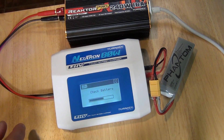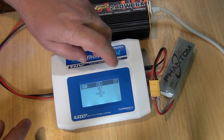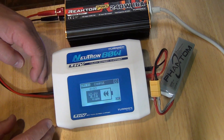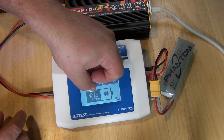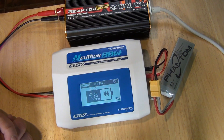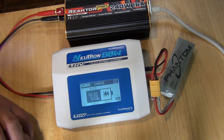Start. And then it checks if the battery is okay. And if it is okay, then it says it is a 3S battery, you did the settings alright — let's go. And now it is charging. You hear the fan going on the side; it always comes on first. And you can see the voltage on the battery is 12.3V. It is charging with 1.3A and it is raising up.